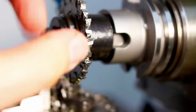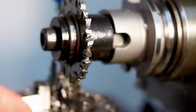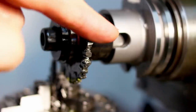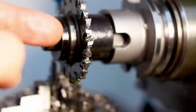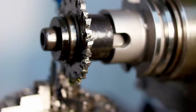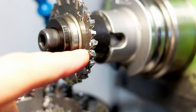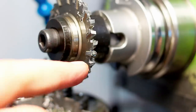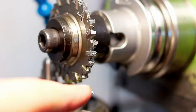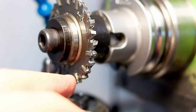This type of wheel cutter with the staggered teeth runs very, very smooth on even a lighter duty machine like this FP1. As you can see, one tooth is always slanted like this, and the other one is slanted like this. And also, they are side cutting. These cutters are not like a saw blade that doesn't have teeth on the sides. These have cutting edges every other tooth on the sides too, which means that you can, for example, use them in axial direction to cut a radius into a part, or you can use them to widen a slot.